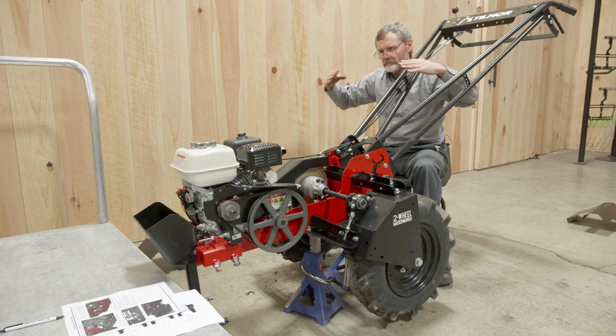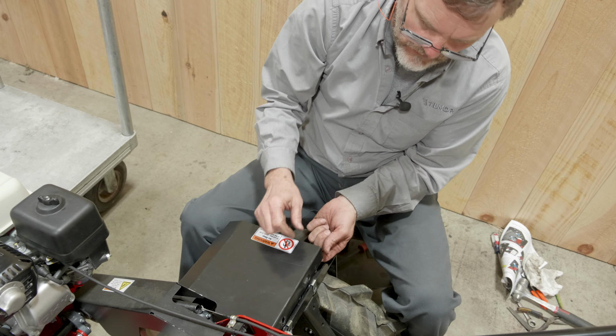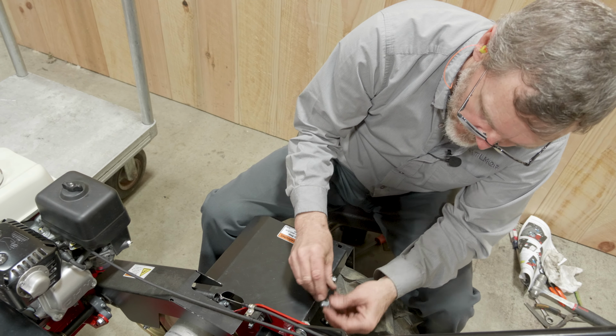We call these extruded nuts, and they're like clips, and so they don't require a nut or you to hold your hand on the other side, but they are somewhat fragile, so just be careful when you're rethreading that you get back in, threaded correctly before you try to tighten it down. And I would tighten these back down with your hand tool rather than the impact. You can use the impact where you have a wrench and a regular nut on the bottom side.